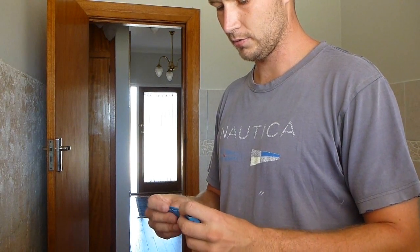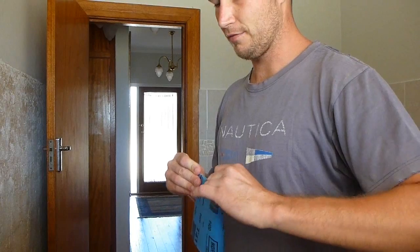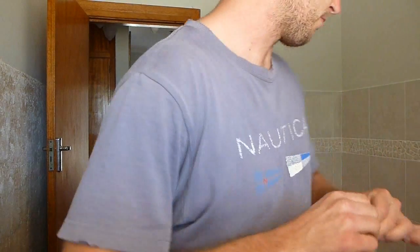The tub's nicely been sanded. I'd probably recommend using 400 grit paper because the 600 is just too fine and who knows if it actually did anything. But anyway, the bathtub's ready to go.